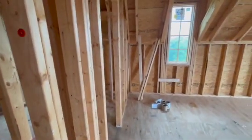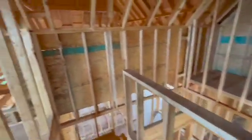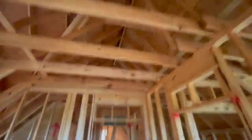All the windows need to be closed when you put them in. You don't need to put them in open — some like to put them in open because they can work it from the inside. You can't do that; you've got to work it from the outside. Make sure all this right here was done and all my bracing was done correctly. My MEP guys are going to come in and they're going to tear this house up again, cutting holes in walls and things like that. I had to go down here and check all my doors, just to make sure we got all our doors in, which we have everything. Shout out to Tim Flynn with Southern Windows Supply — this appears to be the first time everything showed up.